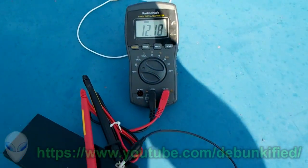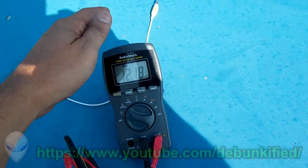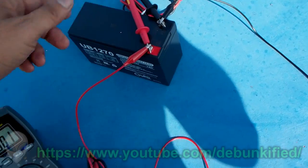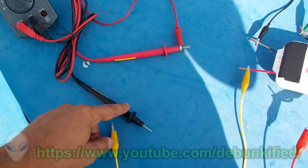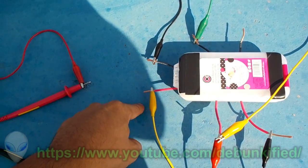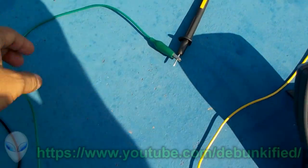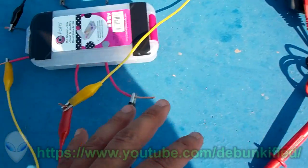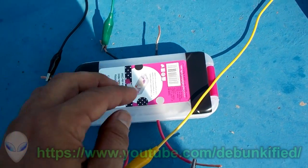We have everything here clearly seen. We have volts here showing the voltage. This is our input power source. This meter is reading amperage coming out of the power source on the positive side, going through our switch into the positive of our input, and then the negative going back. This meter is showing output voltage, and this one is showing amperage on the output. The output is actually made up of two loads, and those loads are part of the circuitry.